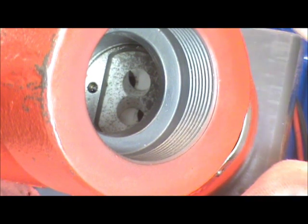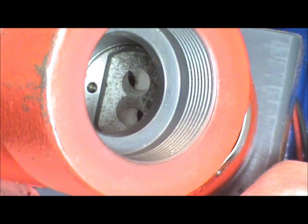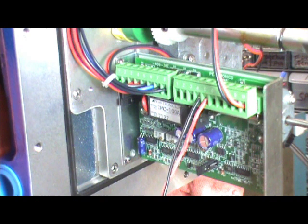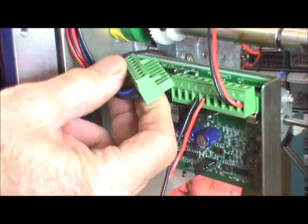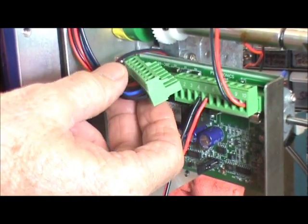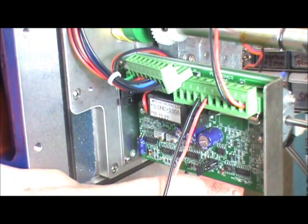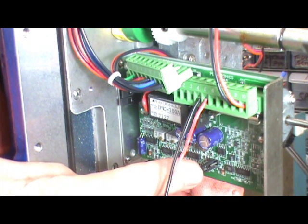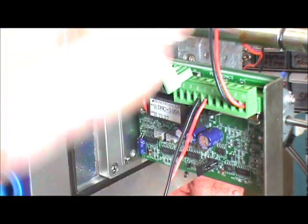What I want to do now is turn off the power to the motor and unplug J1 so we can take a look at the ohms on the pot. Jeff, when you pull J1 off and you still had power to it, it ran the valve closed — that's because the jumper down here was set so that it would fail in a closed position. This one is set so it'll stay in last position, but I turned off power anyway.